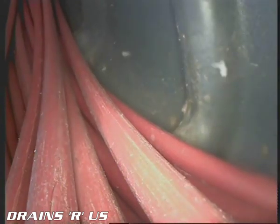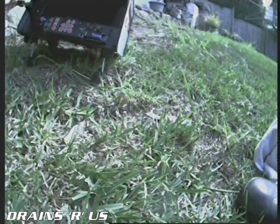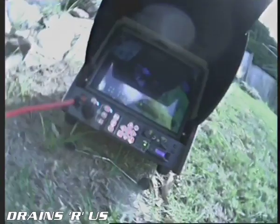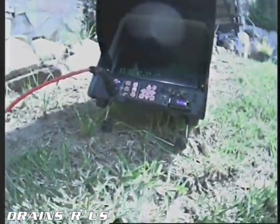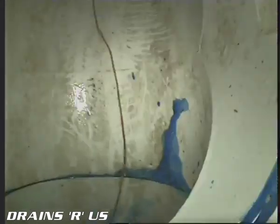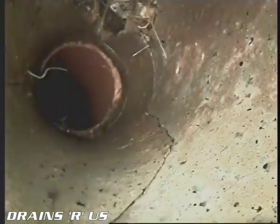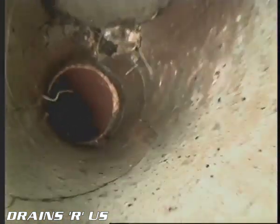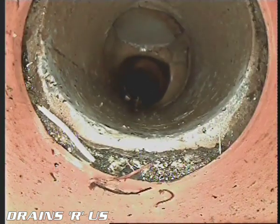The next video will be the third video - after the pipe's been cleaned up the top here. I may have to take all the equipment down the bottom if I've got to get into that bottom shaft, so there may be a fourth or fifth video. This is the final video - I've just finished cleaning. I did manage to get down into the main at the bottom. There's a very badly cracked pipe down there. Going up towards the house - there's a cracked pipe there, all badly cracked, you can see it badly cracked in the bottom right-hand corner, all busted there, busted and broken, tree roots through there, displacement, more tree roots coming through there - it's all clean though. A crack on the bottom of the pipe right up the middle of the screen, you can see it running along the crack, goes all the way. More roots through that one, more roots through that one.